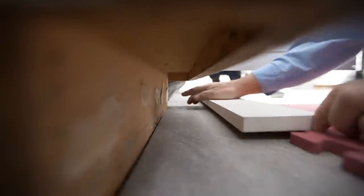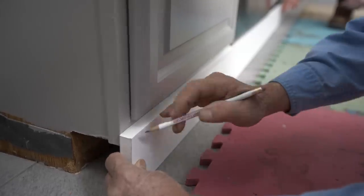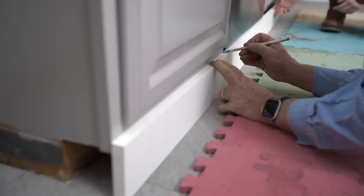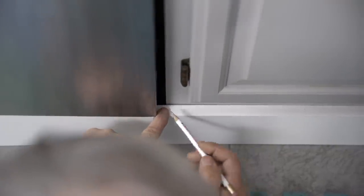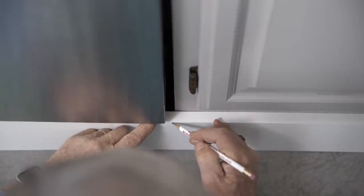I could take this piece of 1x4 and put it up here and try to twist it in, but the end of the cabinet on both sides is in my way. So what I have to do is take the baseboard, hold it against the face of the cabinet, hold it up and down straight and tight to the floor, and mark the locations. We push this one in, make sure it's down onto the floor, and mark it — three locations where I want to notch it.